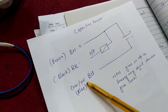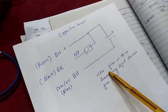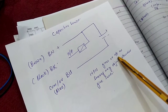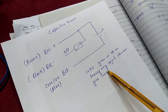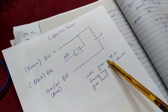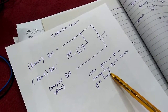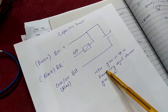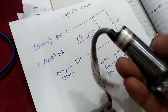BU is the blue wire on which we will provide zero volt, also available from the PLC. This is an NPN type sensor. If it is NPN type, it gives zero volt output when sensing any object, otherwise it provides 24 volt DC. This is the difference between NPN and PNP type. This sensor is NPN type.